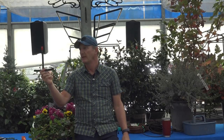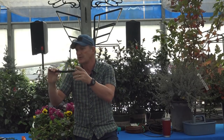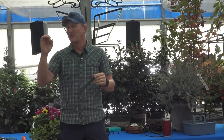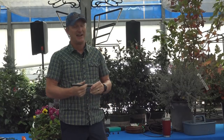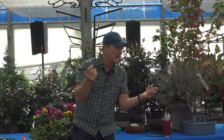This is contractor-grade tubing — what contractors use. It's all called half-inch, but there's actually 0.52, 0.62, 0.64, 0.72 — different sizes, all defined as half-inch. Manufacturers size it down to sell you a 500-foot roll for $39.99, but it may not fit your system. That's important if you're retrofitting or adding to an existing system. If it's a brand new system it probably doesn't matter as much.